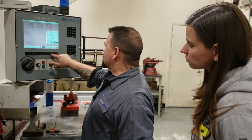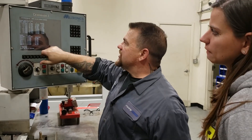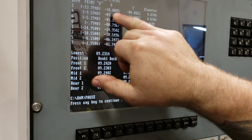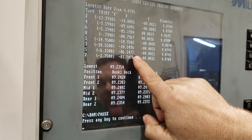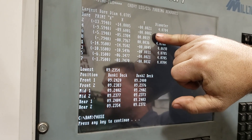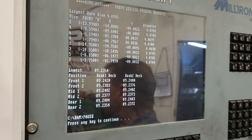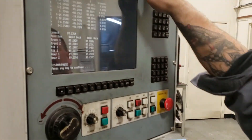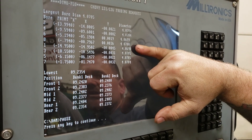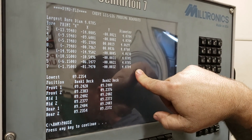Now that we have the data, the machine is going to give us a comparison between what it should be on the print versus what it actually is. So Michelle, we're approximate — it's off about six thousandths, pretty consistent down the line. In Y it's two thousandths to ten-thousandths of an inch. The block's in really good shape. Deck height is 9.2354 at the lowest and 9.242 at the highest. So we're going to just skim it all the way down and make a nice new cut so we know it's perfectly parallel to the main line. The bore is at 4.070 — I took it out five thousandths, just roughed it in so we could see where we could get pistons. We're going to finish at 4.075.